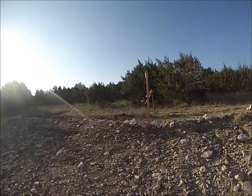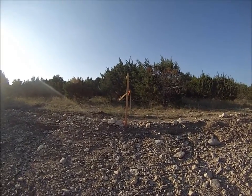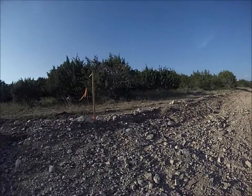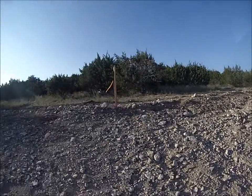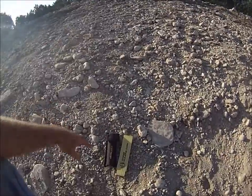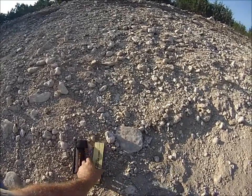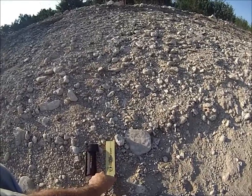I had a video request from a follower on how to clarify how I know that I have drainage from my toe to the creek. The tools I'll use are just simple: this eye level and my engineer's ruler. We use the tenths and hundredths system — those in Canada would use centimeters and millimeters — but it's all the same principle of tens and hundreds.